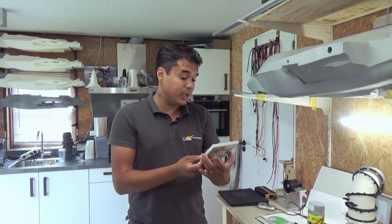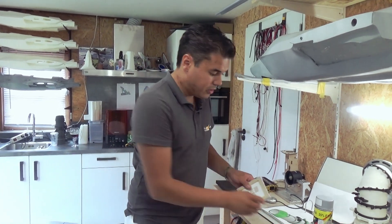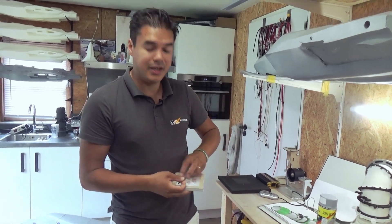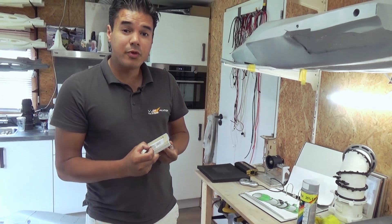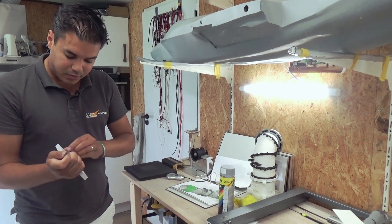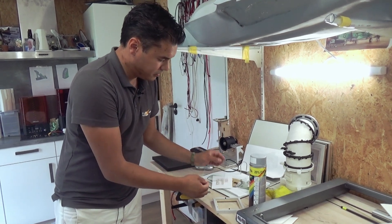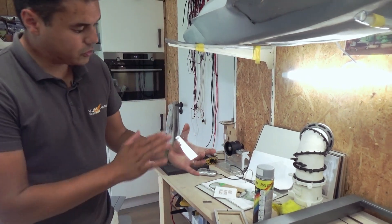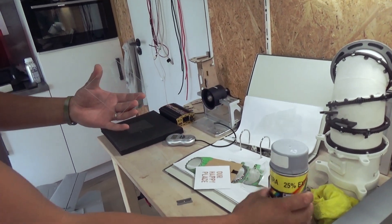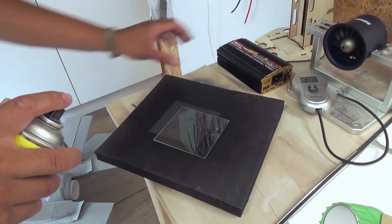In this video we're going to engrave my logo from VGM Aviation into this glass. As you all know, laser light needs to absorb heat, so what we're going to do is spray the glass gray — this will absorb all the heat from the laser energy. Make sure the surface is really clean before you spray it. I'm going to use just one simple spray can of gray primer and paint it gray.